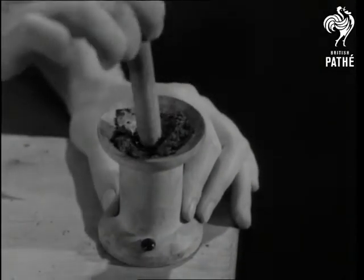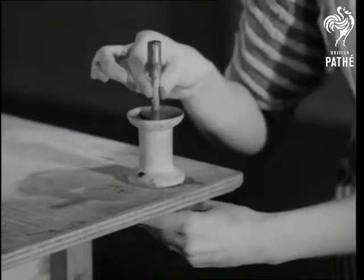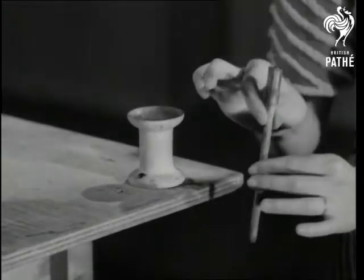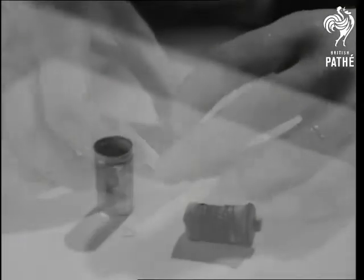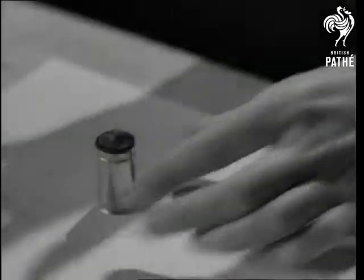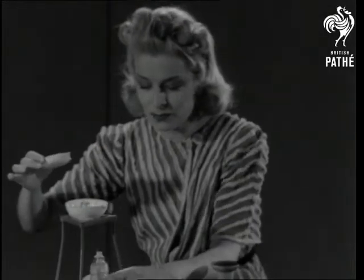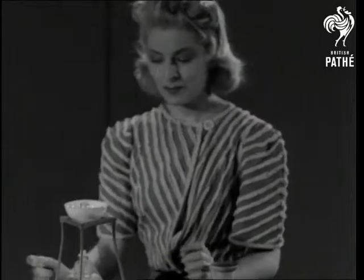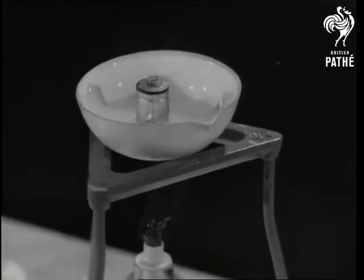Press the mixture into a special mold that's fitted with an ejector, and carbon rod through the middle. Now with the ejector, remove the rod, and you have a dolly of the mixture, which you wrap in a square of muslin. After the ends have been dipped in wax and made tight, the dolly is placed in the zinc can. The space between the dolly and the larger can is filled with the electrolyte fluid, and the can placed in boiling water for a minute, and then cooled. Except for the trimmings, you've made one cell, or half a number eight battery.